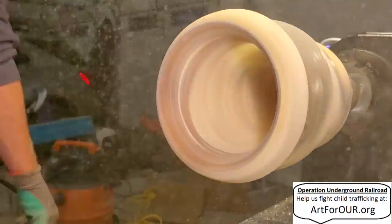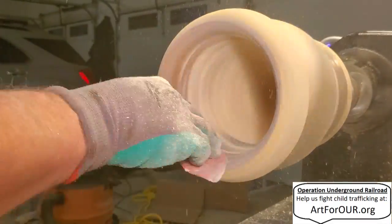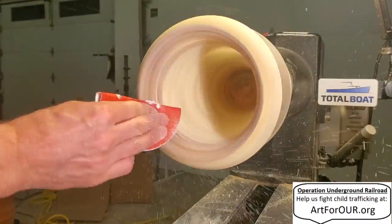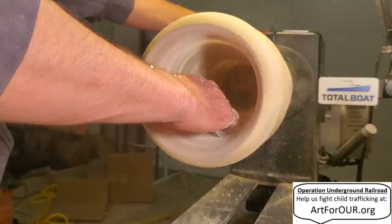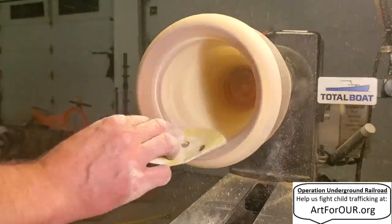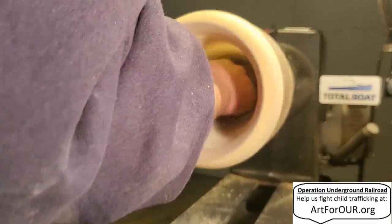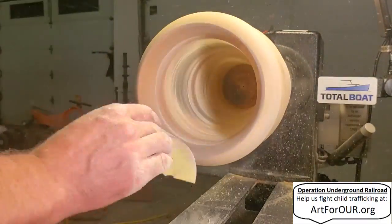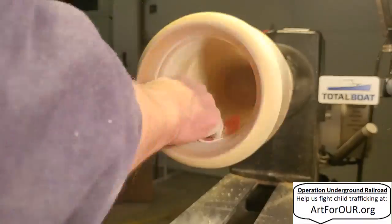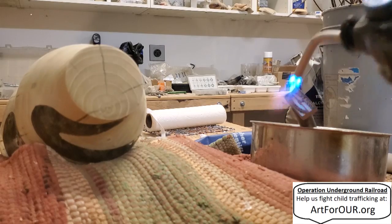Another challenge is with these big tall vases, so much resin sinks into the wood. Kind of like I mentioned, I kind of embrace this cracked look, and it absorbs resin like crazy. So no matter how much extra resin, how tall I build the column of resin above it, it always seems to sink below the surface where I wanted it. So having to do a second pour, often there were bubbles in there, and I'm pretty busy, so I don't have time to babysit the first pour, make sure it doesn't, you know, blowtorch it and all that. This is not my full-time job, so I kind of had to live with a ring of bubbles there, but all in all, I'm pretty happy with it.